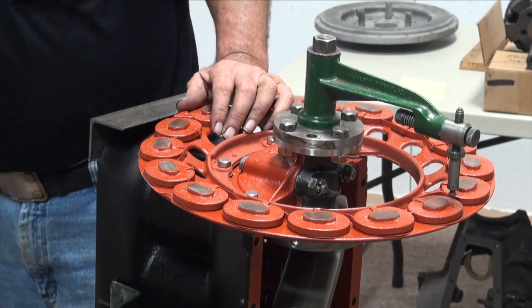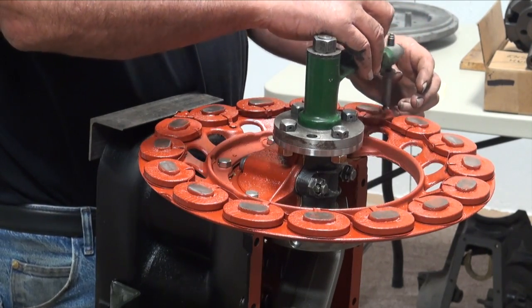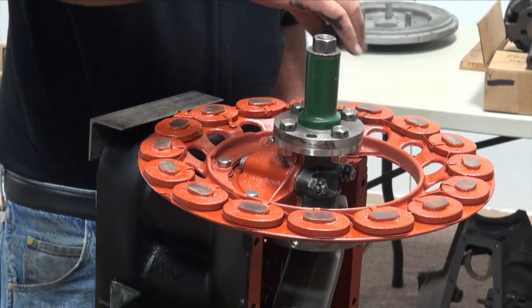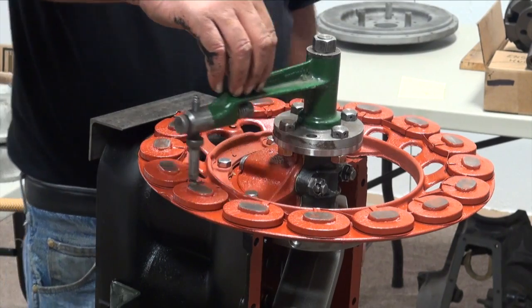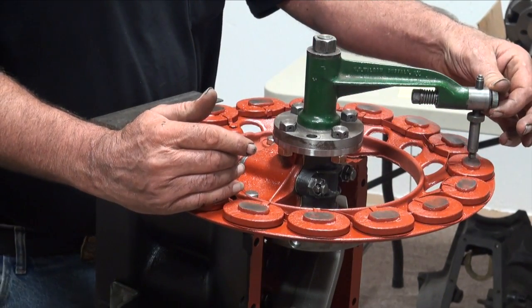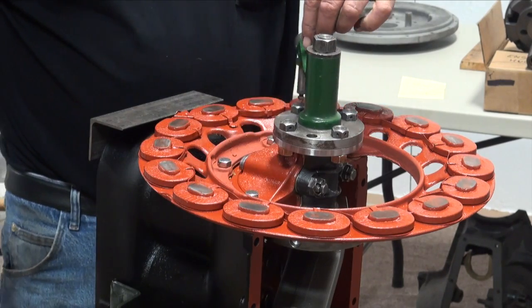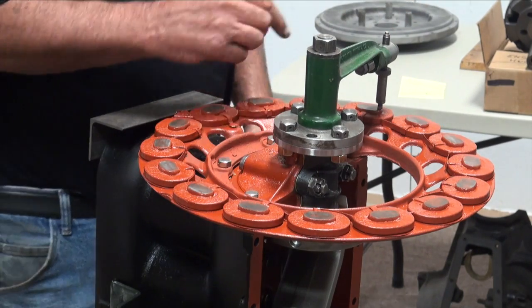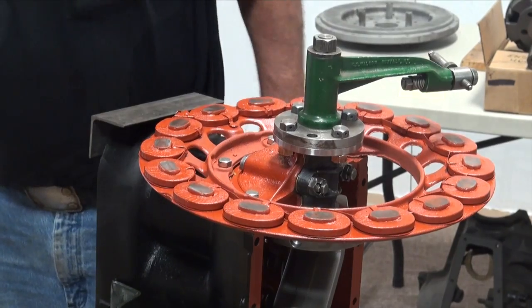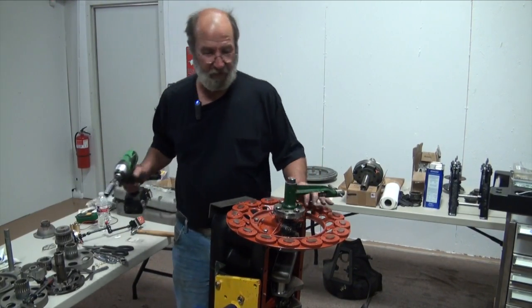Now I'm not touching there. Coming down here I've got a touch and a touch — this way I'm pretty happy. I'm hitting all across that thing. I'm still a little low on this side, so I'm going to pull another thousandth out on this side. We removed one more shim — that would be four shims. If they're a thousandth each, we've taken about four thousandths off of this side.